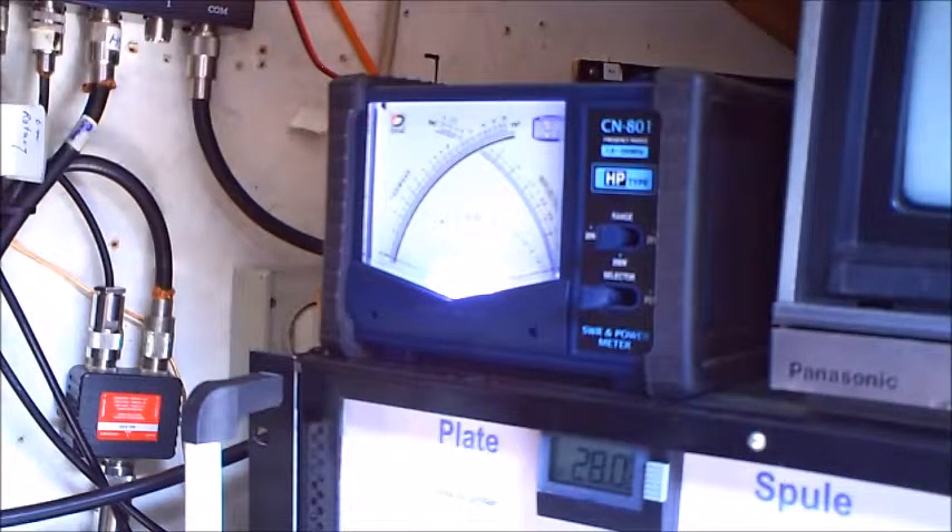On 40 up to 10 meters I don't have this problem. I can run the same on 40 meters with 700 watts and it works. So only on 80 meters I have this problem. It must be something with a coil or the capacitor for 80 meters — a tube capacitor. I don't know what it is. I must search for the problem. Maybe I must take the antenna down to try to repair it, and I'll make a video when I do it. Maybe one other guy has the same problem. So 73. Here is DeltaCharlie2 WhiskeyKilo.